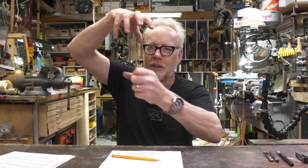This is a great question and worth spending some time on. My first pass at answering is: if you're asking the question, I think what you need is a drill press. They do fundamentally different things, even though the two tools are similar in shape — a motor with a spindle that holds something and lowers it into your work. By that description, drill presses and mills are identical. The difference is that the mill has thousands of pounds of cast iron keeping it from flexing, and the drill press, not so much.